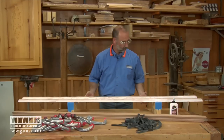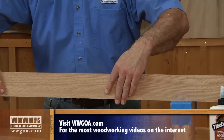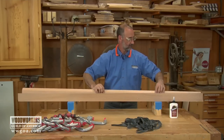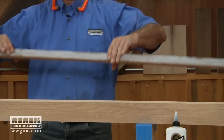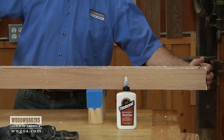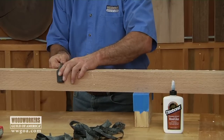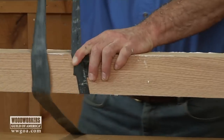Four edges are glued — it's go time. We'll get everything else brought into place. There's wiggle room on the end, so I want them to be close, but they don't have to be perfect because they're going to get cut anyway. Now this is where the first inner tube is going to come into play, right here in the center — I'm going to squeeze my miters closed and wrap the inner tube to keep it there.